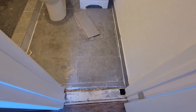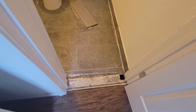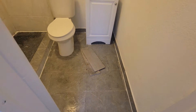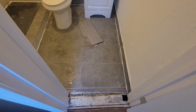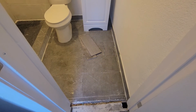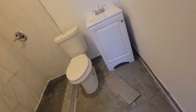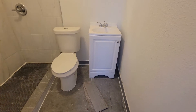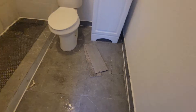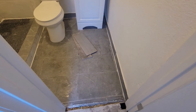So we need to uninstall the floor and the baseboard as well, and reinstall a new floor — possibly the subfloor — because it has to be level. You can see that vanity is leaning to the right. So you have to uninstall the vanity, uninstall the toilet, uninstall the floor, as well as the baseboard.